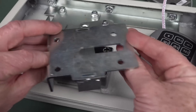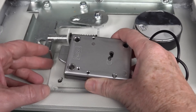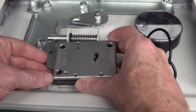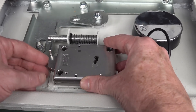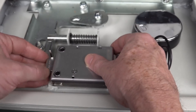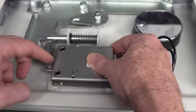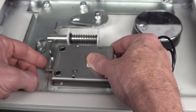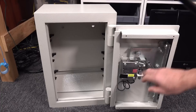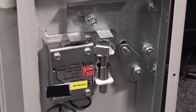You don't even need that plate, but you would because that's an additional drill measure. To upgrade either the Bluetooth lock or the ROS electronic lock — because this is a swing bolt design — we have to actually mount it in this direction so that this pushes on. But if you have it in the other direction, when this tries to push in, even though you've unlocked it, the swing bolt is not going to swing out of the way — it's just going to get stuck. So I've installed the Bluetooth lock down here with the re-locker.